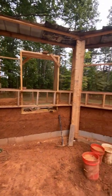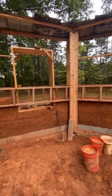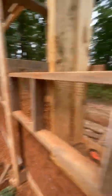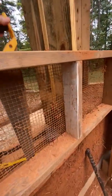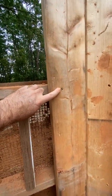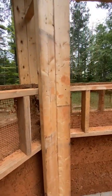This is going pretty well. The cob is sticking to the form somewhat, so in order to separate the forms from the cob I've been having to run a saw down it like that. Then I unscrew the screws — each form is about eight feet long, held in by four screws to the two-by-sixes. I'm able to do this myself, though it is easier with two people. I can unscrew it, shift it up one level, screw it back in, and keep going.